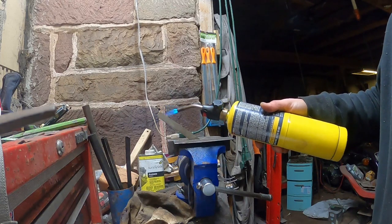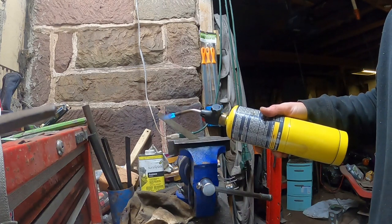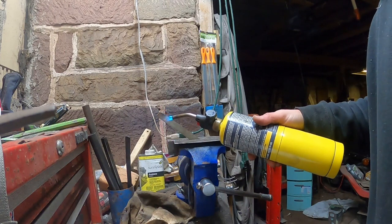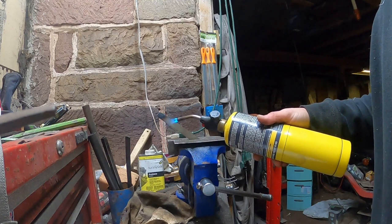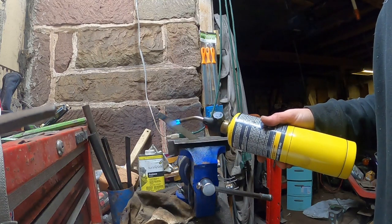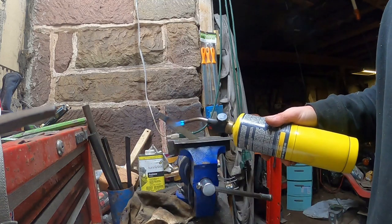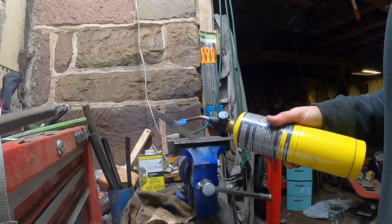So really my goal is just to start to fade that color. It goes from a straw yellow to now it's moving into a brown, and now we're starting to fade into that blue color. So now I'm just going to start to work my way down this way. If you look right here where it's super dark, that's a crack. That is a crack that formed in it.